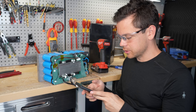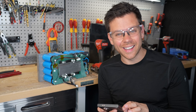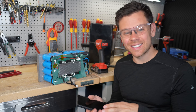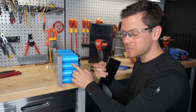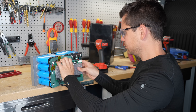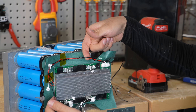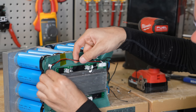Lithium Solar got a different capacity test result — 88.9 amp hours — and mine did 98. So even though the cells look the same, there's a large amount of variance because they're throwing whatever they can find into these things. And this balance lead — this is horrible. This is what you do not want to see inside a battery. This is dangerous.